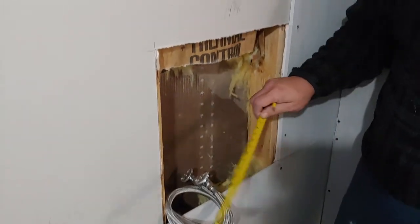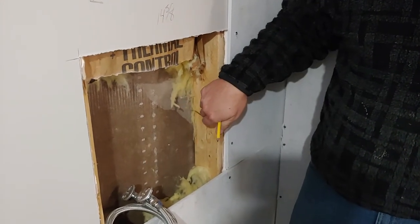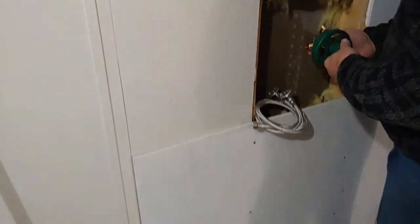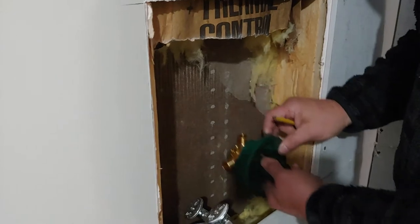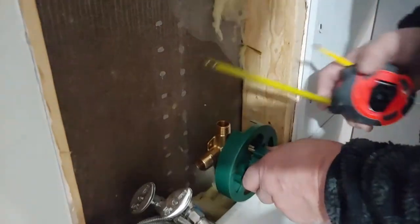We are putting in a shower faucet here, and they bought a Moen shower faucet. The width between these framing studs is 14 5/8, which is very normal. But I wanted to make sure that on this kit, if you notice it shows up right there, this will be at what is comfortable for them, 44 inches. Then I took it to this would be an 1/8 inch further out, and this is your trim ring. You'll take this off, but the measurement behind it is 1 5/8, and that's exactly the width of a 2x4.